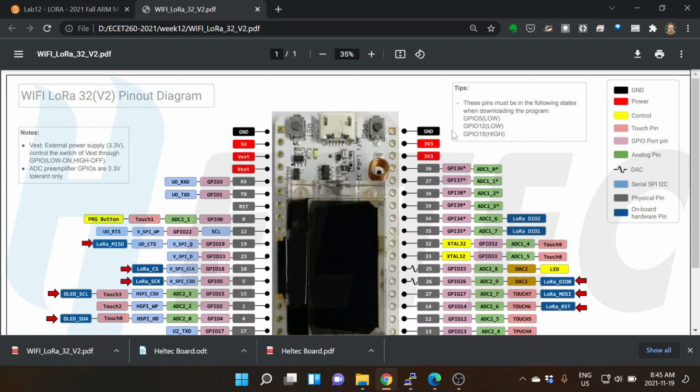Now, some of the pins around what's ground and 3.3 volts and things, these have kind of changed between version 1 and version 2. So you just need to go and look for that. A nice thing about the pinout diagram as well is I'm going to be able to see, for instance, what's being utilized. And so it's highlighting some of the spots. So where some of the red arrows are, it's saying, hey, those pins are there, but we're also hooked up to things on the board.